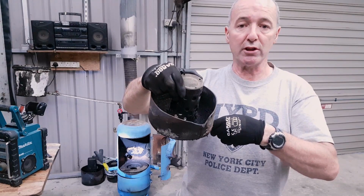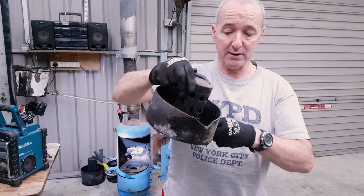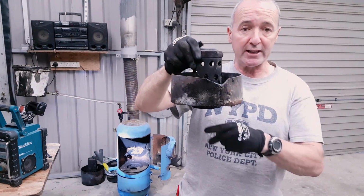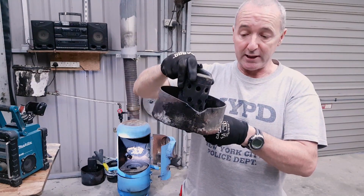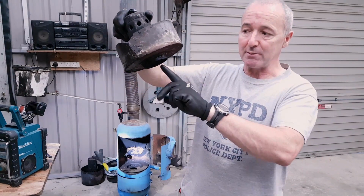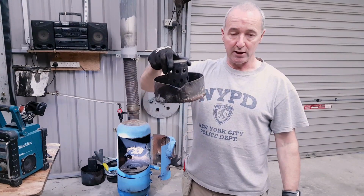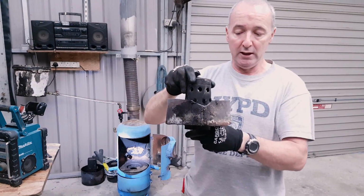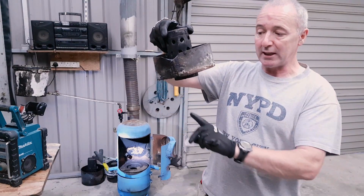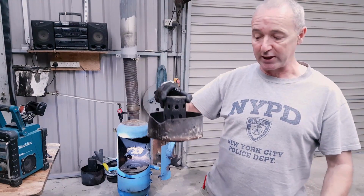And if you have a look at one of the other videos, you'll see how I made a prototype out of just a biscuit tin and a dog food tin or something, a food tin. So you can make one of these very easily out of nothing, really, out of just a few bits and pieces, and check it out and see if it works yourself. But the air has to come through the bottom. Like if you put this on something and just light that, nothing happens. So it works a little like a rocket stove. You can actually hear the combustion happening, but the difference is it must get its air through there, and you need a kind of a reservoir, a chamber around it in order to force the air.